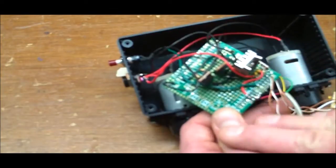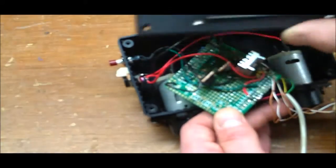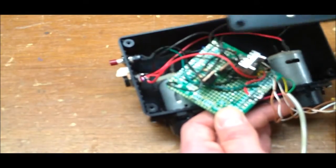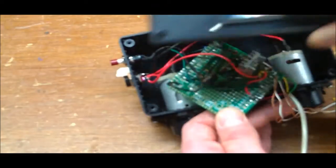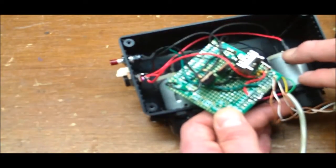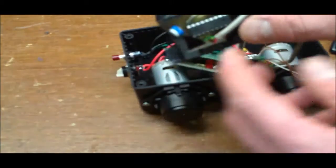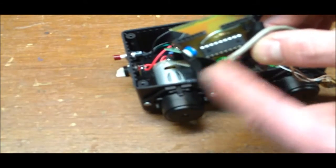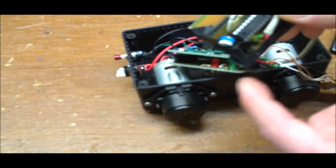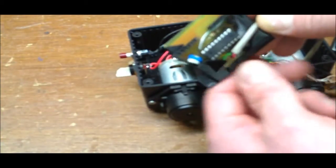With a full Arduino I have plenty of pins to run an LCD directly, but every time the motors came on I'd get garbage data on the LCD screen. So I'm using a port expander chip, the MCP23008, with Ladyada's code from Adafruit. I made a little board for it.